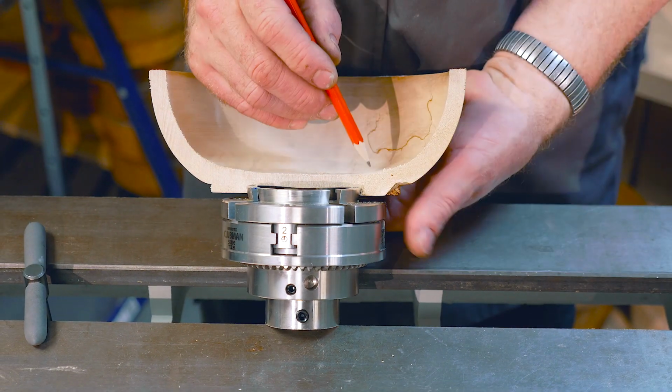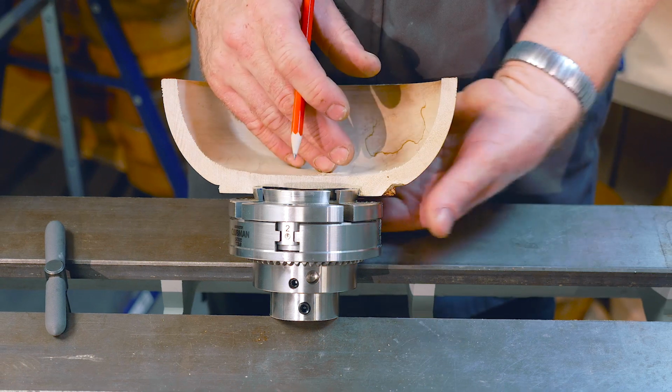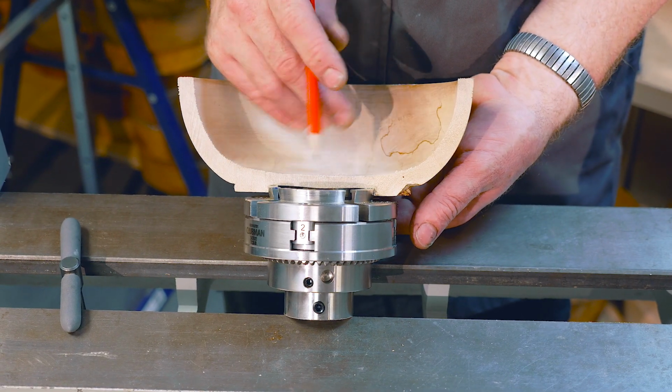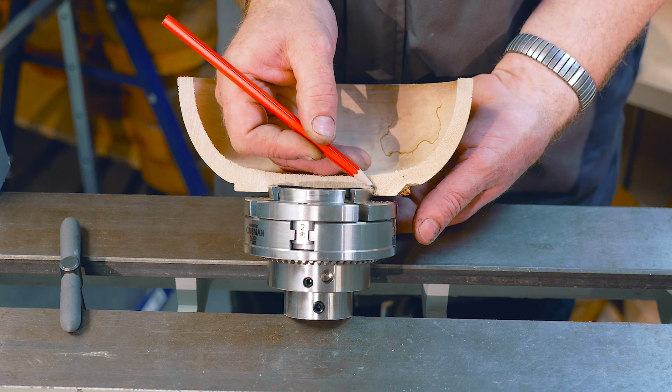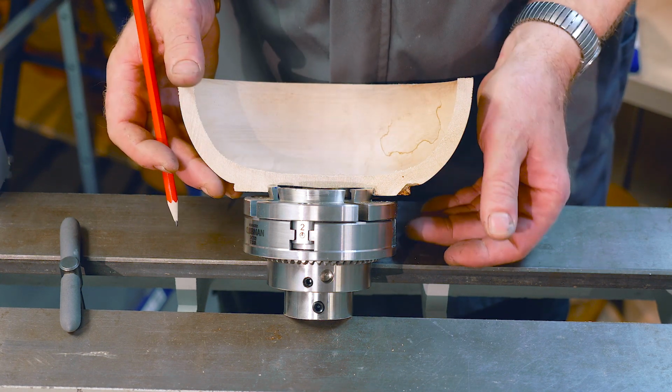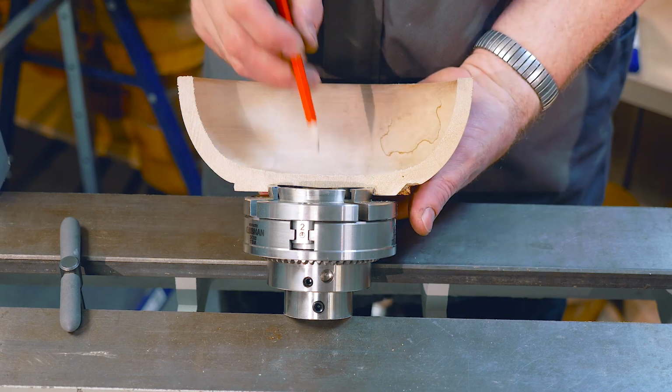So your aspect is making sure that you've got a dovetail that matches that shape, be it with a skew chisel, a dovetail scraper, whatever you cut them with, doesn't matter. But you need to make sure that that angle matches and you're aiming for your true circle. That'll give you maximum grip, less marking.